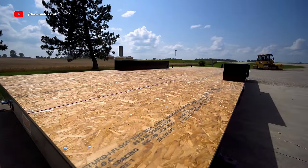Then I'd use my snips again and make 2 cuts along the corners here, and then bend this tab back and cut it off. Then this piece should sit in place on the bottom of the window like this, with the 2 cutout openings lining up perfectly with the edge of the window. Then I'll just nail in this piece loosely for now and measure up the side pieces.